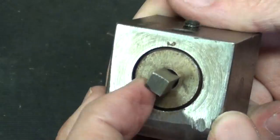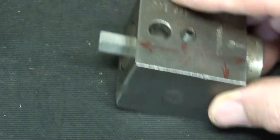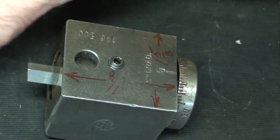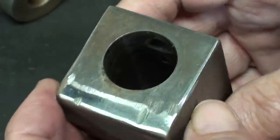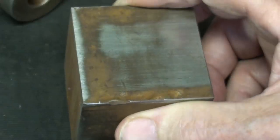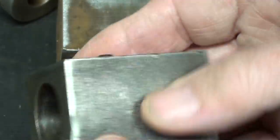More than likely you can get by with just making the one for quarter-inch bits. When you clamp your work into the fixture, you can rotate it at different angles, and you've got two different angles to set it on your tool rest. The rest of this video will be confined to making this part — the main block. It has a bore hole, and I need to mill it to the right size and then also mill that 10-degree angle.